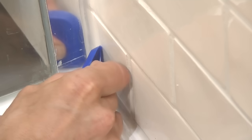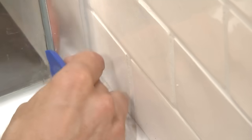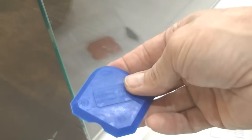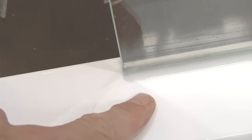I'm going to be using the grey sealant along this joint. So what I've done here is I'm just smoothing with this tool round the corner, working out from both edges away from the vertical joint. Which is so brilliant, this tool, because if you've got any excess like I've got there, you can simply just wipe it away. No need for the special attachment this time, I'm just going to use the original Fuji. Working in short sections because you simply don't need to do the whole run in one go. Then I'm just going to trim around the corner to get that lovely clean edge.